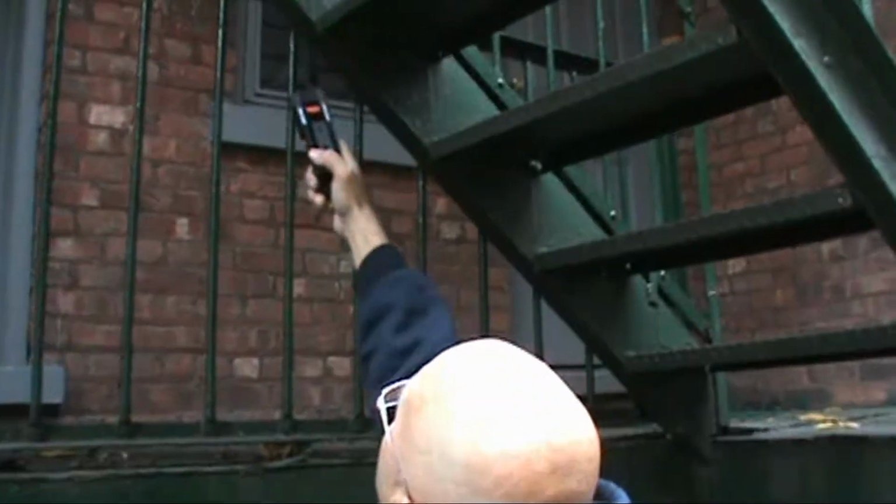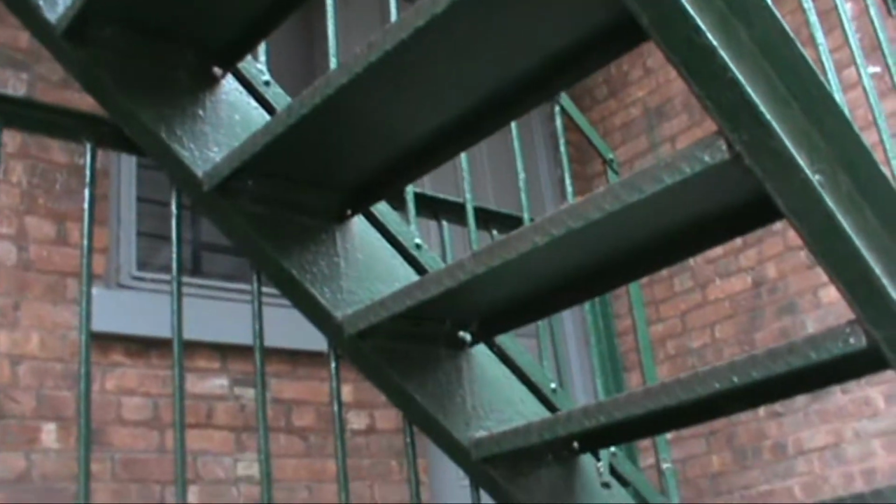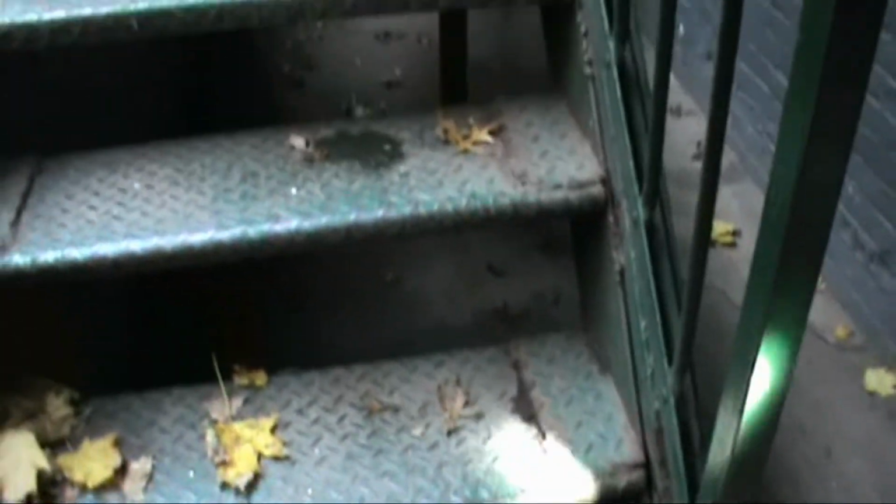So remove the rust. And if you look over here, I think it's here that you start seeing just how much rust jacking is occurring. Look at, you can see it here. But let's go downstairs. This staircase down here is probably the worst staircase of it all. The feet are not properly attached. Tons of band-aids that were thrown in here with welds. Tons. All unverified, so this whole staircase needs to be reinforced.